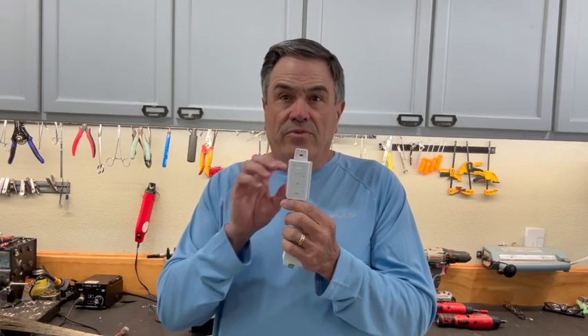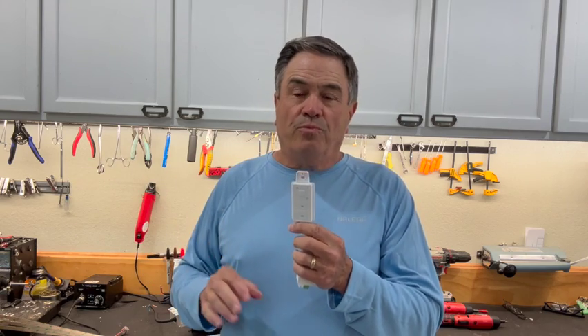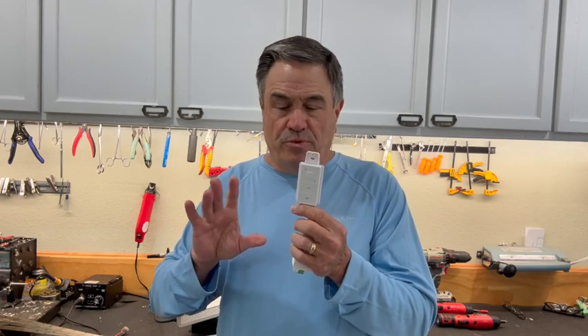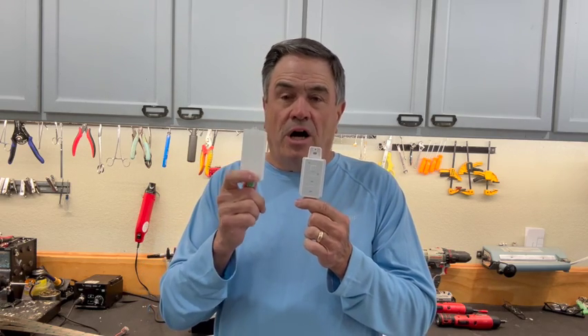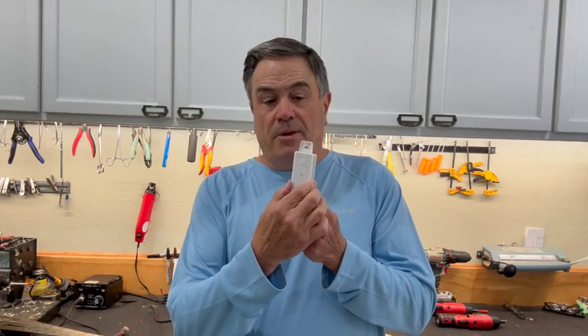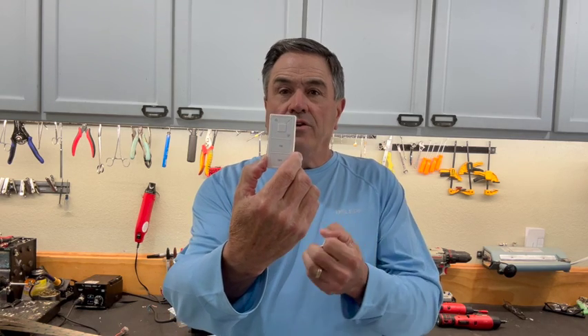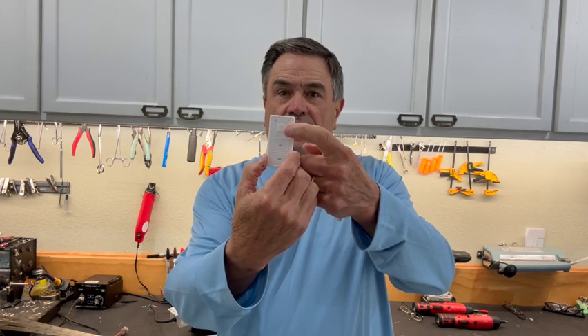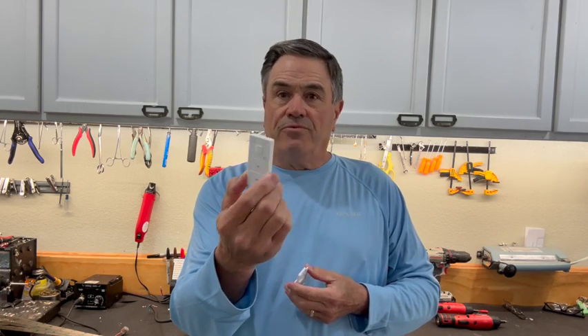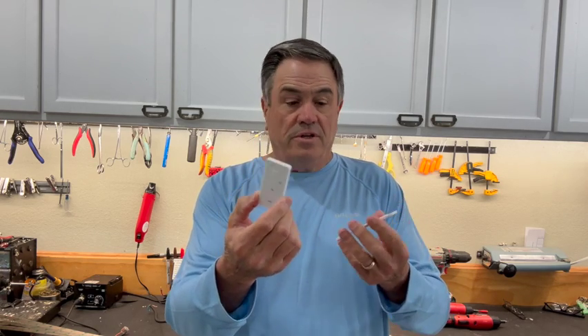You operate the Meanwell with an RF radio frequency type switch. This one is my favorite. You don't have to have any wiring going back and forth across the room — it's radio frequency, mounts to the wall, and you put a decor cover on it. It talks to the little module hooked to the power supply. You can take it off as a remote control to dim up, dim down, or set a preset on and off. It works very well for long distances and through walls.